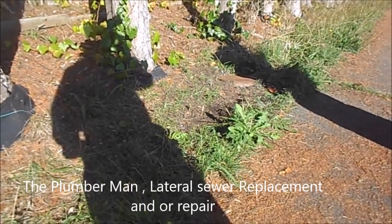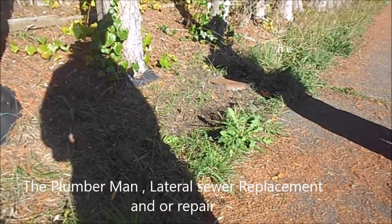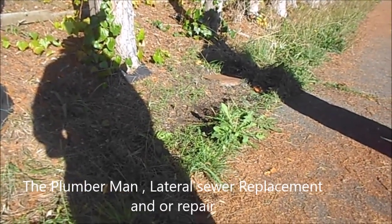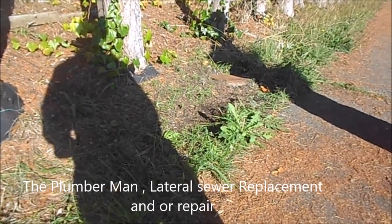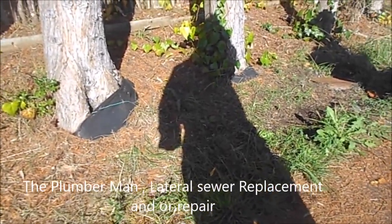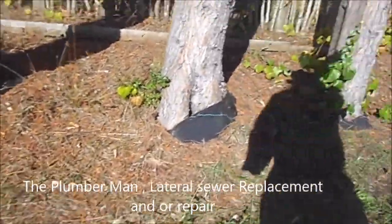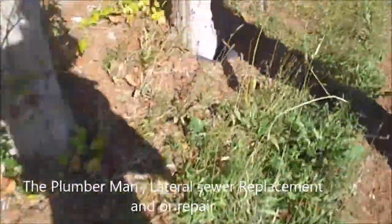Laying the pipe is easy — I knock that out real quick if the trench is done right. If the trench isn't done right, I come out and struggle. Now this cleanout here — if we go straight from there to there rather than coming down and over, I usually get like a 45.